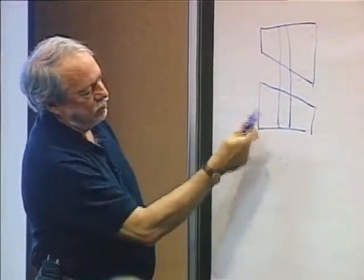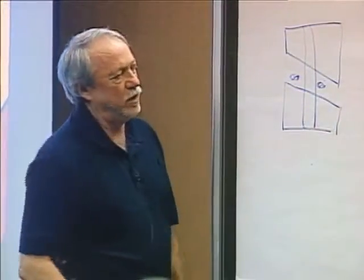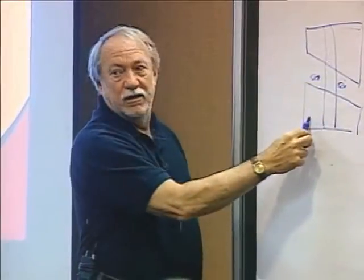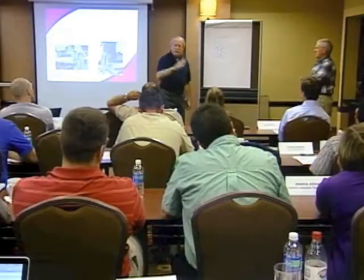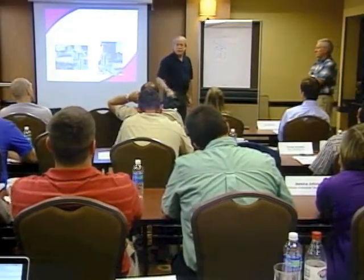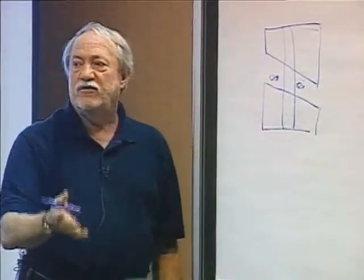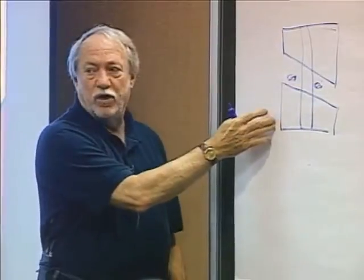and they have these idlers, or whatever you want to call them, these cans on either side of that belt. When you move those cans, you force this belt to the high side or the low side of the pulleys, and that increases or decreases the speed at which that belt travels. How's my drawing? Okay. So you take these cans, you move that belt one way or another, and you're going to increase or decrease the speed of the belt. That's what we call a cone drive.